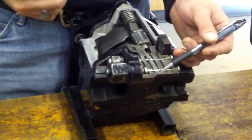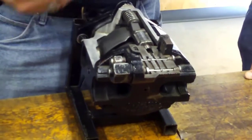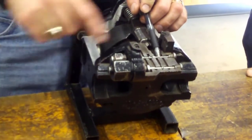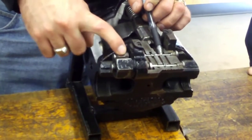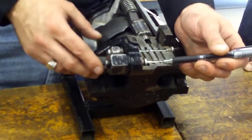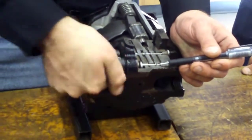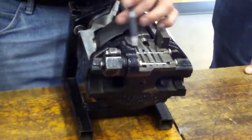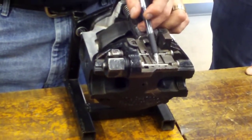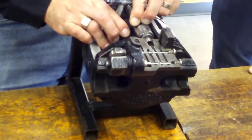This is our pressure compensator, and this performs the pump cutout function. Once we reach 3,000 psi as the maximum system pressure, the pressure on the pump outlet pushes on this side. But the load sense side is 3,000 plus 350, so 3,350 psi — the load sense spool would never shut off on its own. So instead, the pressure comes up here against a spring set at 3,000 pounds of force, and we can shift this spool over. When that spool shifts over, pump output comes through here and straight down to de-stroke — de-stroking at high pressure, not the lower pressure. That's how you hit your maximum pump output.